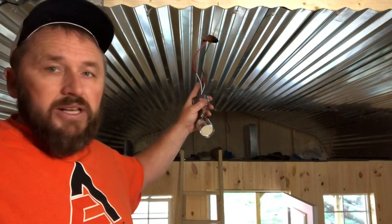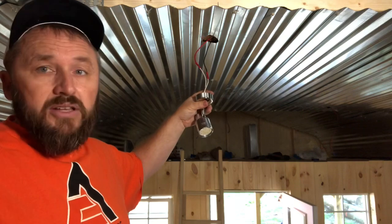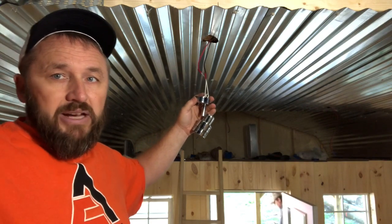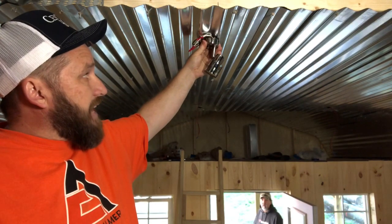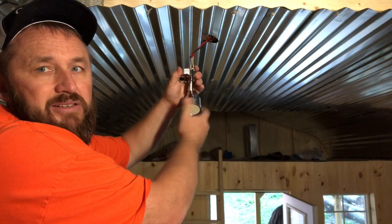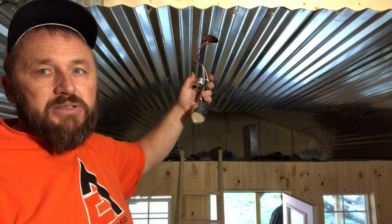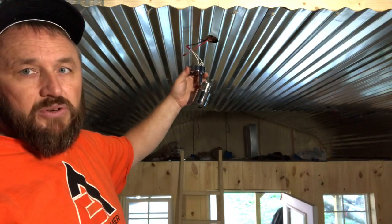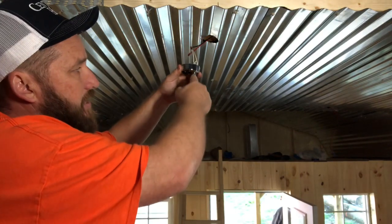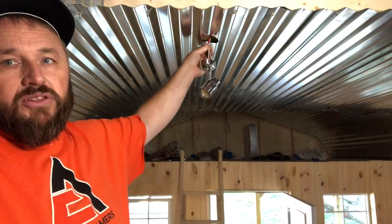This one's all done. I'll push the excess wire up into the loft and then secure the light. What I'm going to do — and this might be a mistake but I can always correct it — is have them facing towards the wall to start. The manual says this can spin 360 degrees, so I'm not too worried about direction. I want to keep it uniform, so I'll put the switches to the outside exterior walls and keep the post going towards the interior walls. Wires are crimped and we're going to install these lights now.